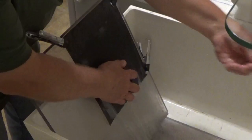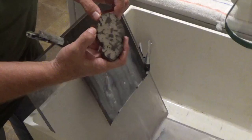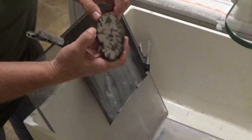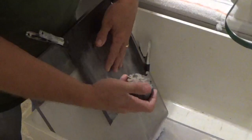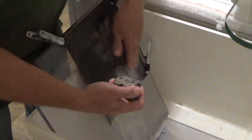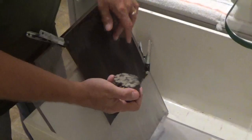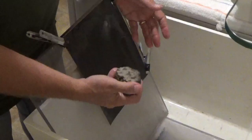Now I'm going to take the specimen off and examine it. I'll rinse it off. I still have a major little dip in this area, so we have a little more grinding to do. One thing to note: once you have removed the specimen from the sanding paper, you need to rinse the specimen and the paper before you put the specimen back down. Sometimes the piece you're grinding will have little pieces of grit come off. If you put this back down on top of one of them, you'll put a big scratch in what you're trying to smooth out, which will ruin what you've done and you'll have to go back to the coarser grits.